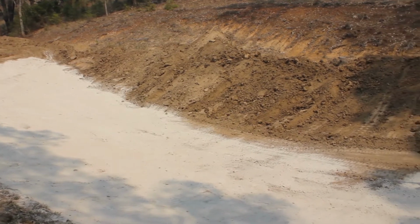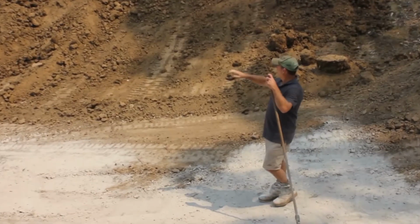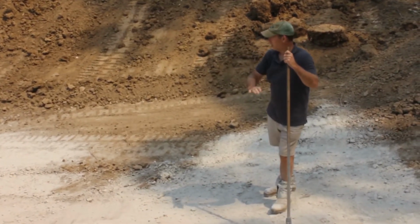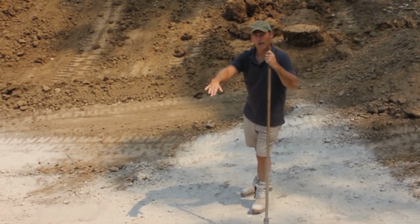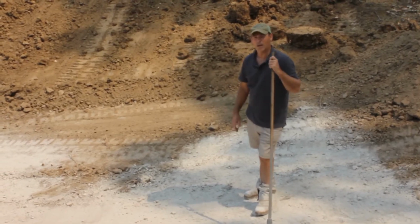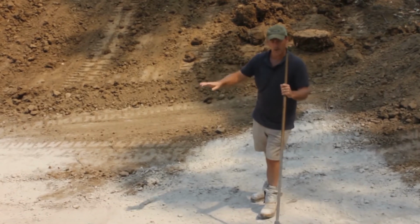And we're placing it over the area that we feel is the biggest risk for leaks, which is obviously not the entire dam. That back edge of the dam is less of an issue. It's the front edge of the dam where water can actually travel in, down through natural ground and underneath the wall that's been constructed, because we're pretty sure there hasn't been a key cut before this wall's constructed. So you can see we've actually got a nice thick blanket through here.